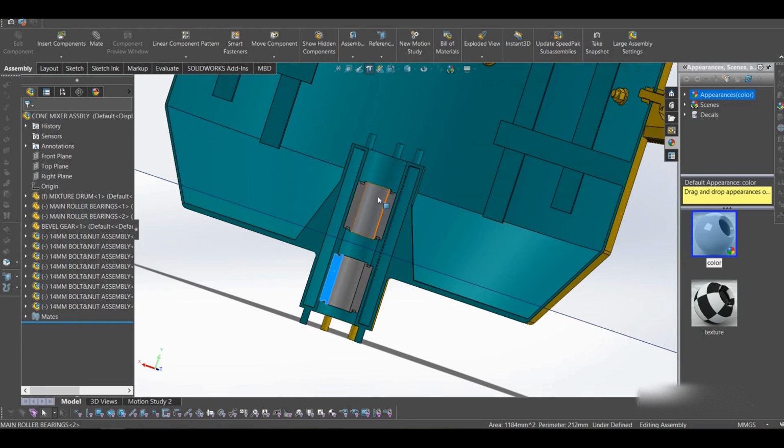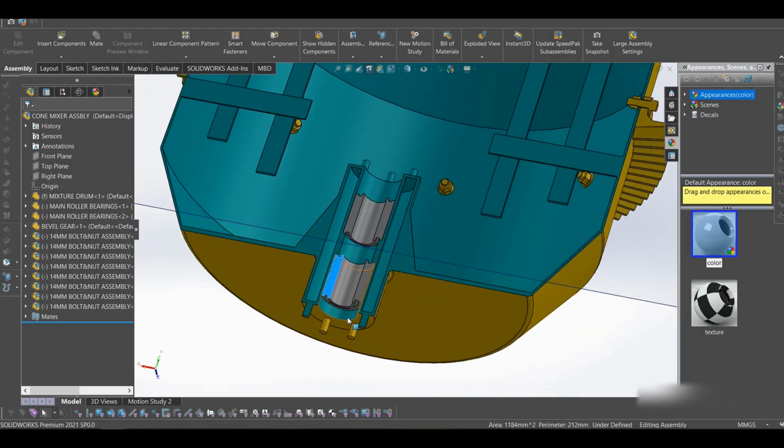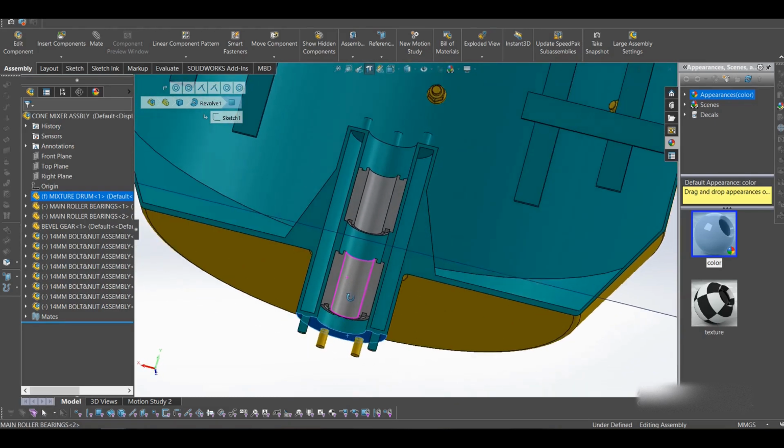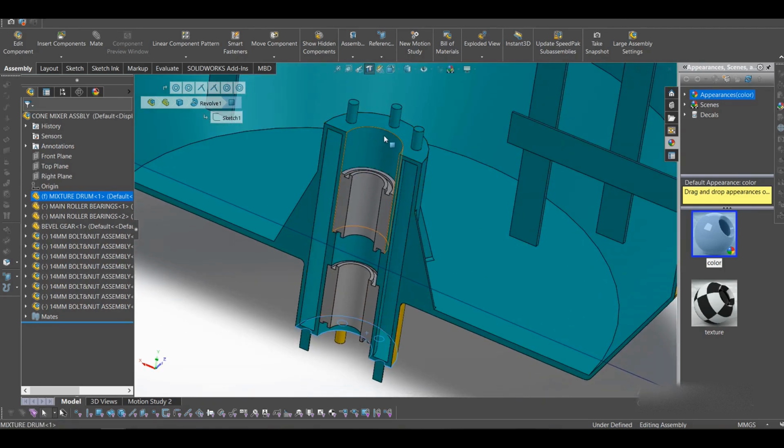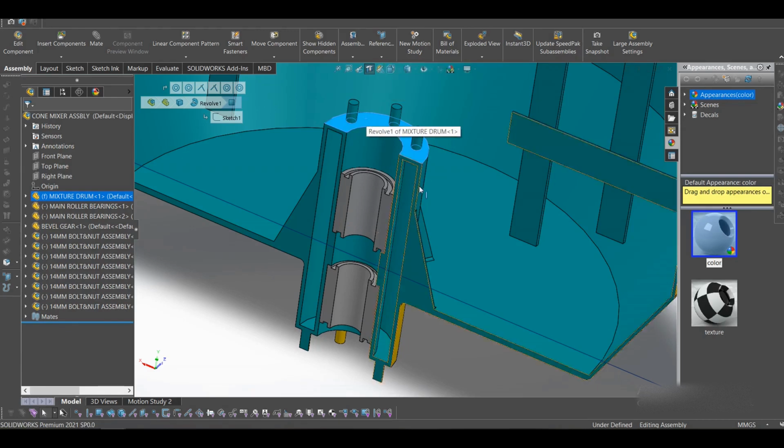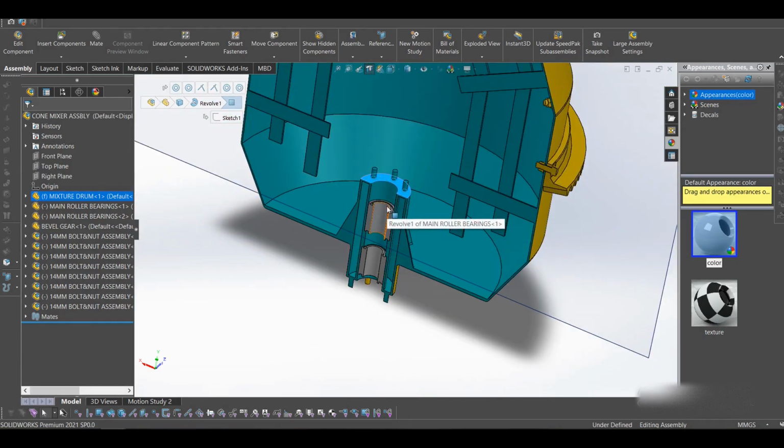Then we have the bolts that will be locking the upper bearing. So then we might have a seal here, then the cover, then some bolts. Even here we shall put a rubber seal at the bottom. On this surface we have a rubber seal to keep the grease in. Yes, and on top we shall also use a rubber seal to keep the grease in, and we tighten everything up. The grease will help prevent water from going into the bearings, and even the rubber seal will do the same job.